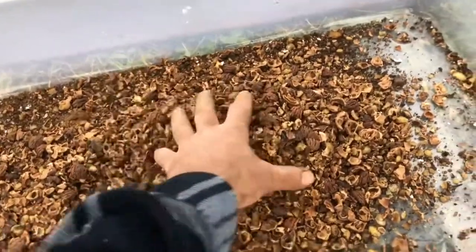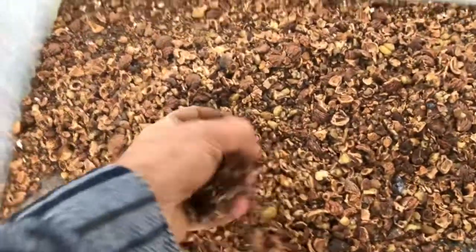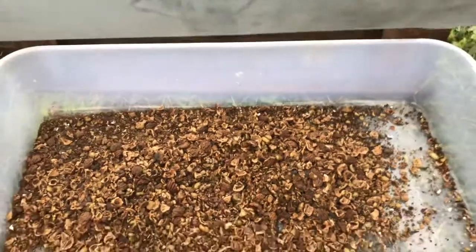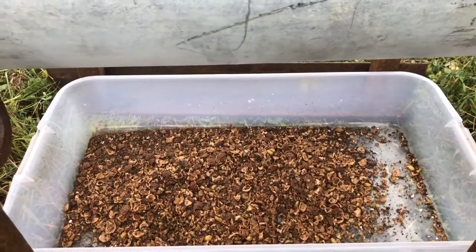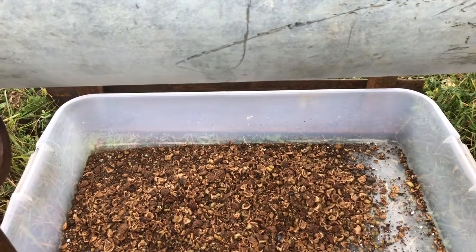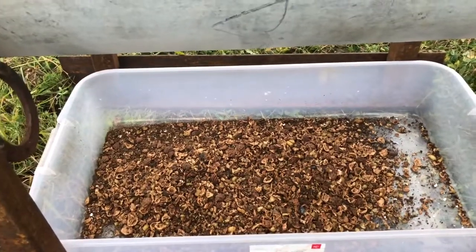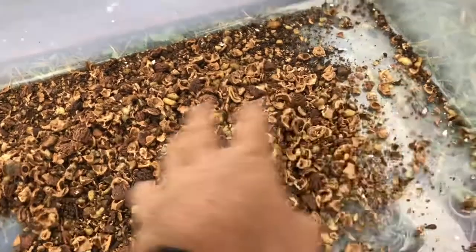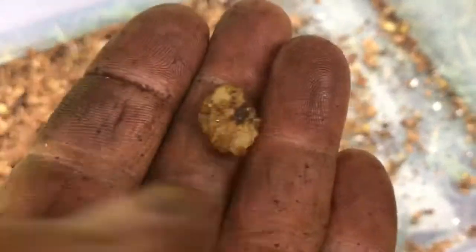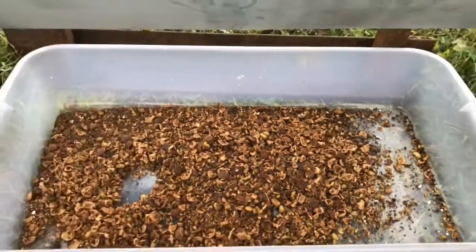So I just designed this cracker. I had to work on it about three or four times, taking it back to the house and welding on it. But this cracker will basically crack everything down to the final size — I don't have to keep rerunning nuts through it. It cracks at lightning speed faster than my other cracker. With the other cracker you have to keep closing in the gap on the crowding plate and rotating drum, and you get a lot of retainers. Here you get no retainers. You'll get a far better nut yield — no nut meat left behind. I don't get full halves but I do get a lot of quarters. You don't pulverize the nut meat because there's some elasticity to it since it's still wet, and we'll dry that later.